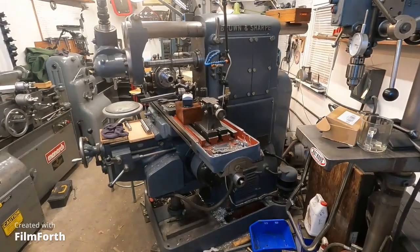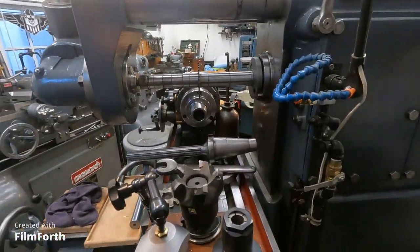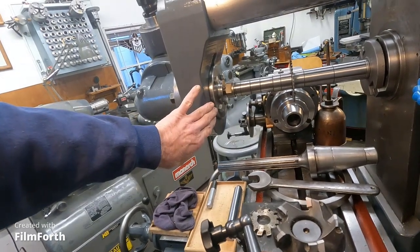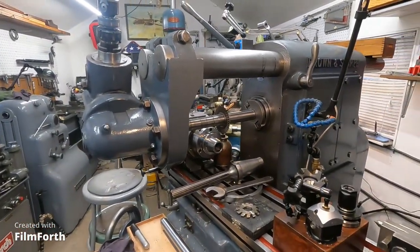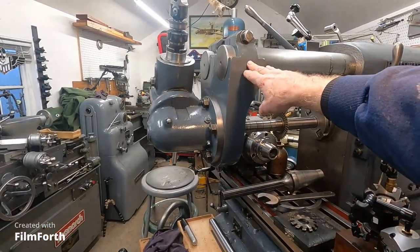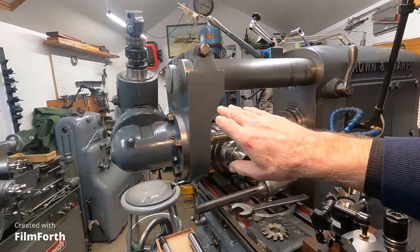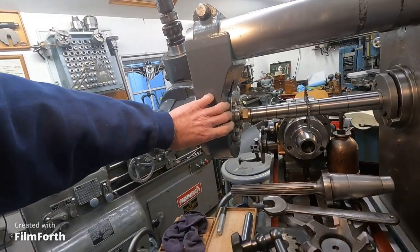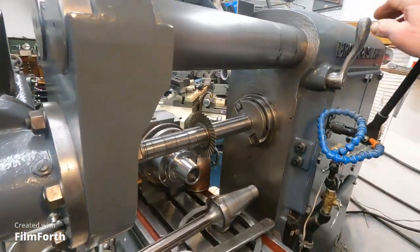Now this milling machine is really coming along great. I've got this horizontal arbor bearing — it's really nice; I haven't used it yet but I will. If you haven't seen this mill before, it's got this sliding vertical head attachment here, and it's really heavy with this yoke — it's a solid cast. It's hard to remove and put back on. So what they did was they had an adapter, and it was missing, so I just made one out of this piece of steel. I'll show you the alignment on that — it was kind of a tricky deal.